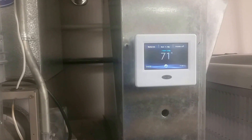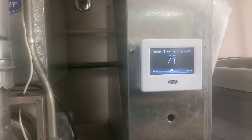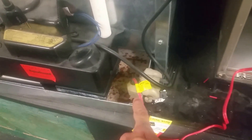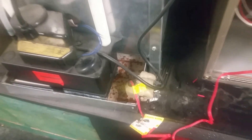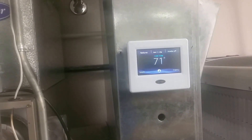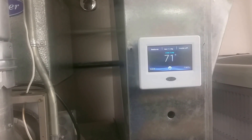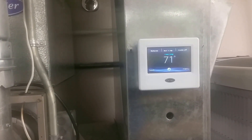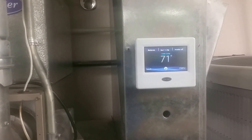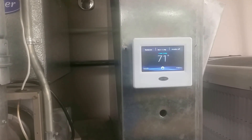G terminal shutdown — many have heard of it, some know what it's about. Here's a basic way to think about it: this is your safety shutdown circuit. The purpose of a safety shutdown circuit would be a float switch in an attic, an Easy Trap switch — a float switch like this one here that we've got hooked up. We're going to use it as an example. Years ago, we've always hooked up safety switches to either break power to the thermostat or to stop the outdoor condensing unit from coming on.